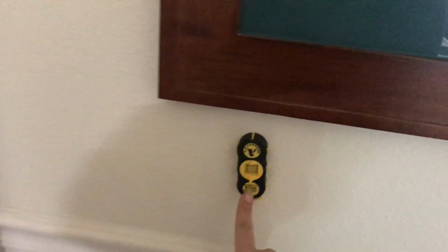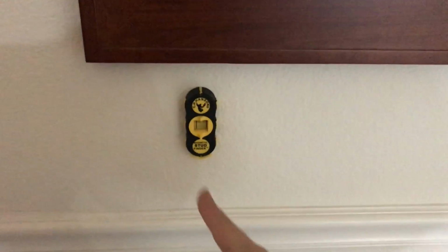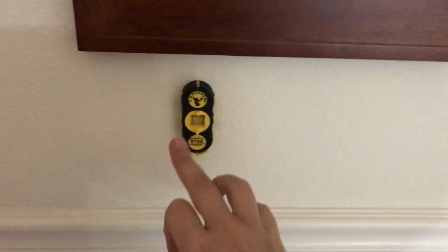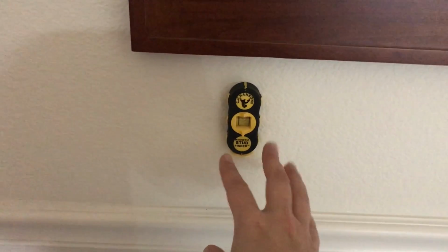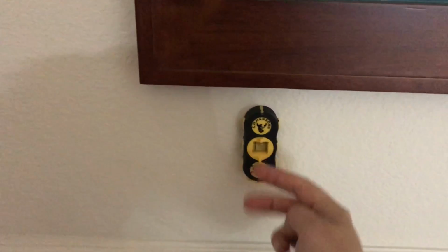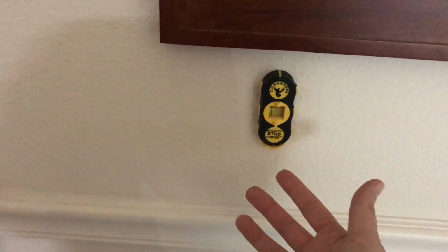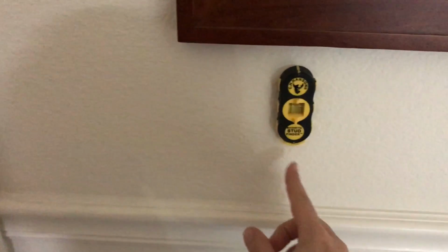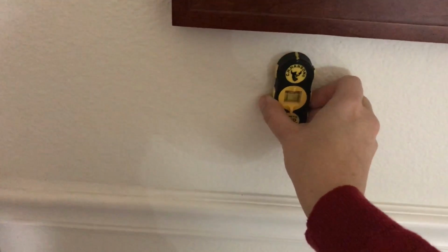So the way that it works for walls, again, some of you may already know this, but just in case you don't, is you basically have studs that are running up and down, usually about 16 inches apart, and then you have on top of that the drywall, and that is nailed in place usually, and then usually tape and then all painted up. So what this is actually sticking to means that there's a stud there that's going up and down, and this is really useful in addition to just finding the stud really fast. It's nice because if you know where the nail is, you know that you don't want to be nailing or screwing something in because you're just going to hit metal there. So that's super nice. So let's actually leave this there.